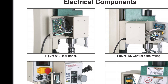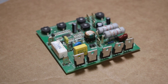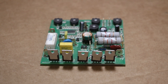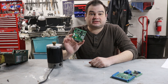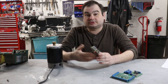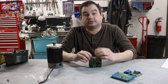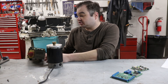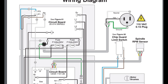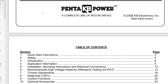This is the spindle speed control board — it's a basic DC motor controller. This one, as it came from Grizzly, is actually a very clever and almost exact knockoff of a very popular spindle motor control board called a KBIC 120. This DC motor controller is actually pretty common — so common, in fact, that if you were to burn one out, you could find a replacement on eBay. It'll control just about any DC motor as long as you match the ratings of that motor to the outputs of this board, and it has a changeable resistor for different horsepower-rated motors. I even checked and the mini lathe has one inside its control box as well. I even checked the wiring diagram that Grizzly provides for the machine, and it matches up — it reconciles with the motor driver spec sheet that KB provides for their version of this board.